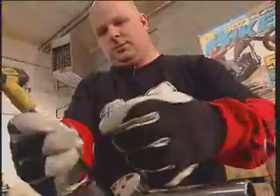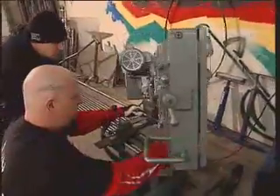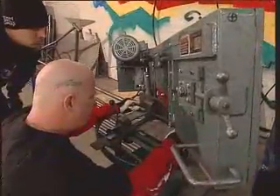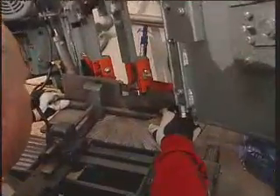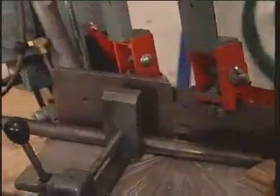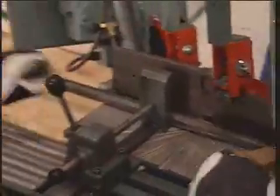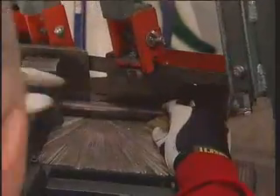So what did I say, 11 and a half? Yep. What you're going to want to do, bring this down so you can get your right length on it. We're going to go like 5 and a half. I made a little block that's got 30 degrees on it. It'll give us a 30-degree tip. So off the straight bar, the bars will come back so that your hands aren't all tweaked out weird. So get that set up, your 30 degrees, get a mark back there, and go ahead and cut it.